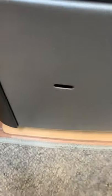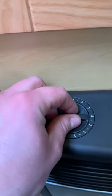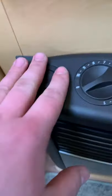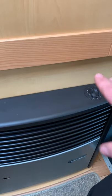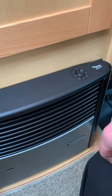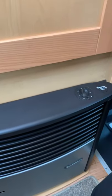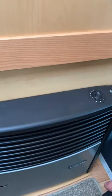Look through this little hole and you'll see it light up. When it is lit, hold it, hold it, hold it, then slowly let go and turn it around like that — it will come onto the main flame. Keep your eye on it to make sure it stays lit for a little while and you'll be good. I'd recommend leaving the fan running for five or ten minutes after you've had the heating on, because you get a big rush of heat from the top if you don't. Just leave it on for a little bit after you've turned it off.